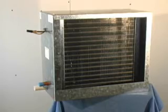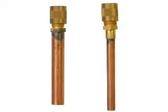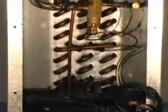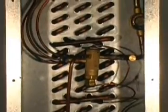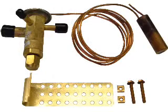The refrigerant cooling module, RCM, comes complete with R22 thermal expansion valve, sight glass, 2 access ports, and an external freeze stat to be installed at the fan coil. With the refrigerant pre-pipe modules, RPM, the expansion valve, sight glass, access ports, and freeze stat are factory installed. All Energy Saving Products refrigerant modules are heat pump ready and can be ordered with the R410A expansion valves.